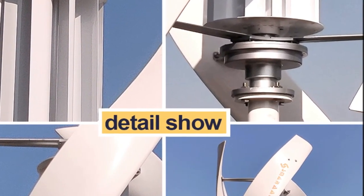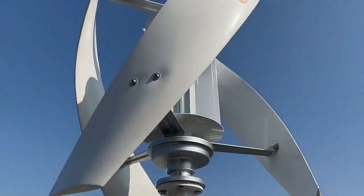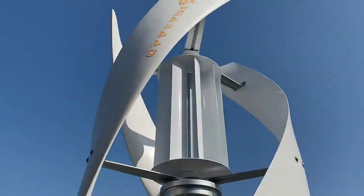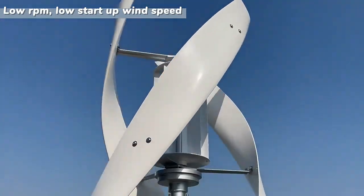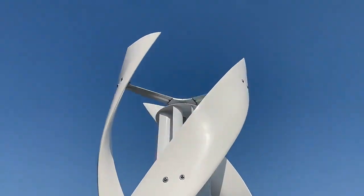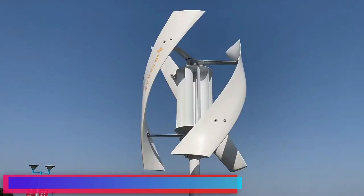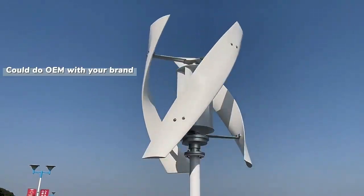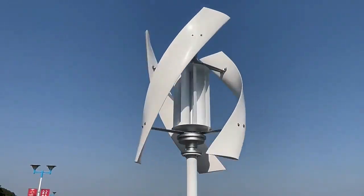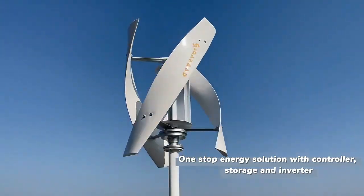For a simple version of a VAWT that you can build yourself, Blueflower has published several mechanical drawings that detail the layout of the design. The wind power generator uses 24 magnets, copper wire fashioned into coils, and a metal plate for the main generator. The coils are arranged in a circular formation on a static plate, while the magnets are equally spaced on a moving circular plate. As the magnets pass over the coils, the flux induces a current, which increases as the plates spin faster.